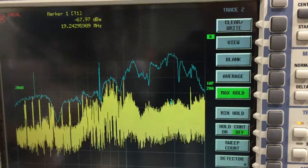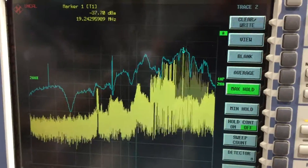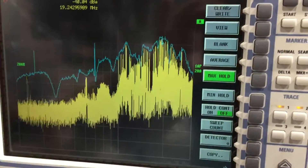It's using probably all 200 megabit right across the HF spectrum from 2 to 30 megahertz. It doesn't seem to be jumping anything below 2 megahertz, so it's obviously got a filter to stop it getting into the broadcast band, but it definitely wipes out HF for sure.